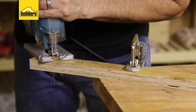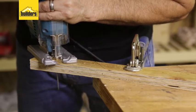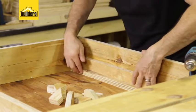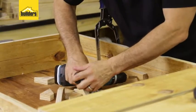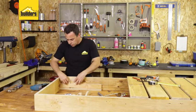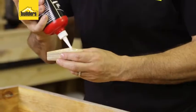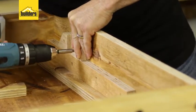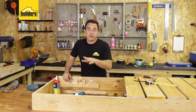I'm going to put four either side, so I need a total of eight. I'm going to cut them using a jigsaw, but you can use a normal cross-cut saw. I'm putting in the bottom runner, using a piece as a spacer to bring it up from the bottom. This is the 500mm piece which was pre-cut, so let's get that runner fastened first. Now I'll put the wedges in — four either side — starting the first one 150mm from the side at the back, using material thickness as a spacer so the spacing is the same every time. Both ratchet racks are done.